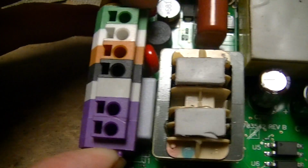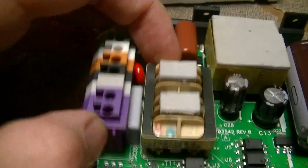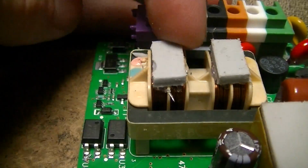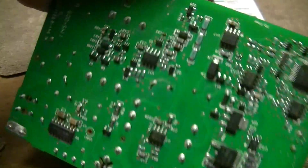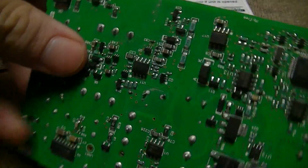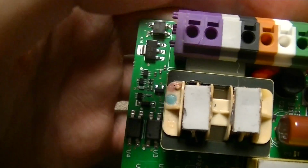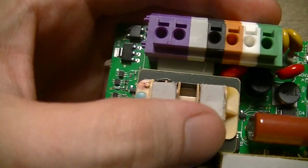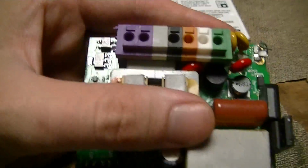But anyways, a couple of common mode input things. Actually, this looks like two common mode filters on one core. Judging by the position, it's a 4-layer board, so I can't trace a lot of the wiring on this thing, but I guess that one of these is for the bus, just to keep out common mode noise in either direction, and the other one is just for the mains input.